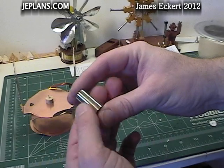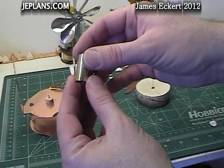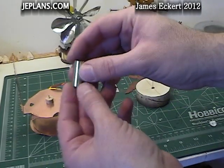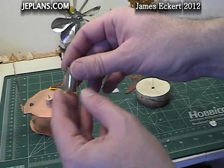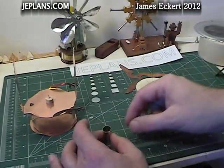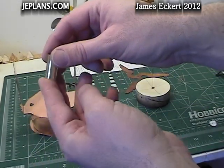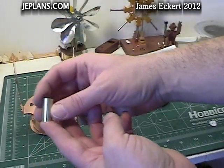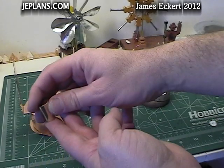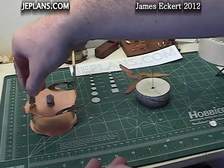Piston cylinder — it's slightly off square. I made a mark on it indicating which way it is square by turning it around with the square on the edge. It can tolerate being a little off side to side from looking straight on, but not front to back. So I'm just going to line that mark up forward when I glue it down.